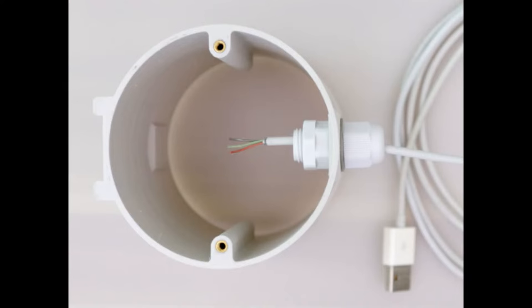I really like cable glands because they're such a good, low-cost, easy solution. There's two pieces. This is a nice cutaway that Noe and Pedro did for a project. You can fit a cable through if you want the cable to leave the enclosure for sensing or for power input, or Ethernet, whatever, USB. The two pieces come apart, you put your cable through, and then when you screw the pieces together over the wall of the enclosure, there's an O-ring and a gasket, which I'll show on the overhead in a bit, that squeeze together, grip against the cable, and make a weatherproof or waterproof connection.